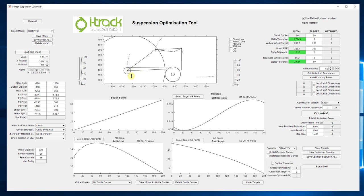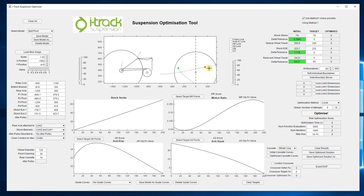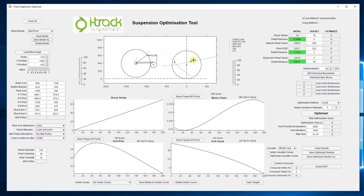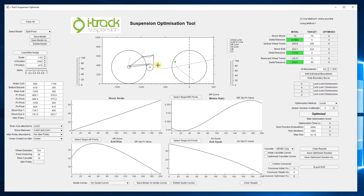What we're able to achieve here is that the axle still moves about this point in a circular arc, but the brake caliper doesn't rotate about this point anymore. Instead, the brake caliper rotates about a virtual point out here called the instant center. Basically as the suspension moves, that instant center tracks along a virtual path. By projecting that instant center further forward, we get much lower anti-rise figures than we would if it was a single pivot and the caliper was mounted on this member here.